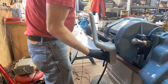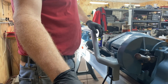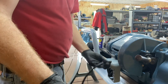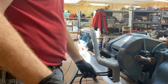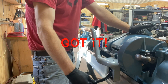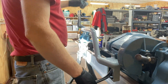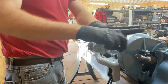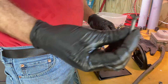The wire doesn't want to move at all — I'm kind of stuck and can't get it to go either way. I'm wondering if I put a bunch of grease — I think maybe these cables are a little sticky and somehow twisted around each other and won't go around the corner. So I put both wires hooked up to the snake and put a bunch of oil around the casing of the electrical wires, and that seemed to do the trick. The fact that both wires were moving rather than one being stationary also helped.